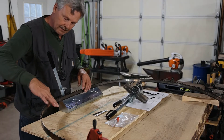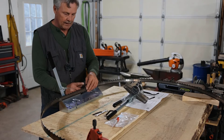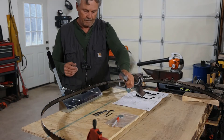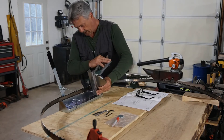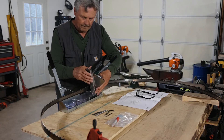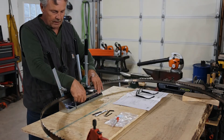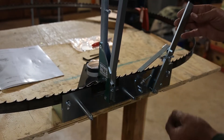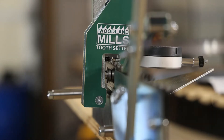At this point you need to find the weld seam on the blade itself and start there. On this particular blade the weld seam happened to be where the tooth was straight up, so I started on that and I'm going to set everything that will be to the inside of the blade first. We're going to get this on here to the inside and lift it up enough to where it gets across the blade. Once installed on both bolts it should rest freely. We just laid our blade inside the two slots and I've set my slider up to where it's just resting on the back side of the tooth, setting right at the edge of the tooth.